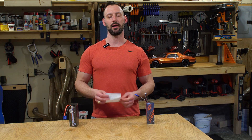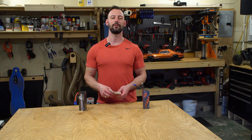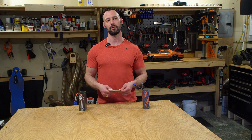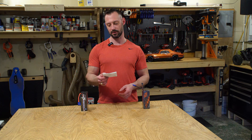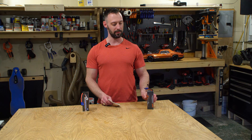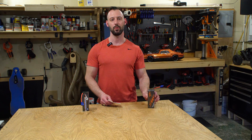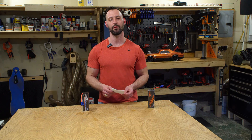I did this test from a fully charged battery down to 3.6 volts, which I consider a usable voltage. You don't want to discharge LiPos too low, even though some manufacturers say you can go down to 3.3 volts. The HRB discharged 5,800 milliamps from fully charged to 3.6 volts, which is 96.7% of its specified capacity of 6,000 milliamps. Compared to the China Hobby Line, we discharged approximately 6,250 milliamps against its specified capacity of 6,600 milliamps, giving us 94.7% of its capacity in that voltage range.